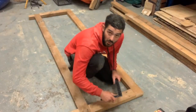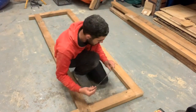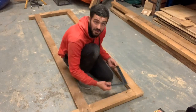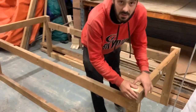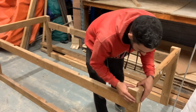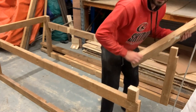I've checked both opposite corners using the 3-4-5 technique and both are working out perfectly. I'd like a bigger square to get a more accurate reading, but that is absolutely bang on, so I'm happy. I'm going to get that screwed up while I'm waiting for Matt. Matt's finally arrived back - he's brought me a Starbucks, so we can carry on. We've done the same lap joints for the cross as for the full length, but we do need to fine-adjust - it's just a fraction too short on the joints and not quite lining up, so we'll just take that back to the mitre saw for a bit of fine tuning.